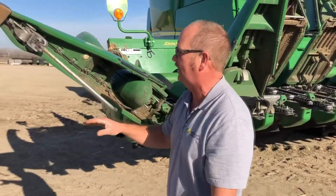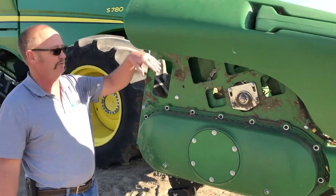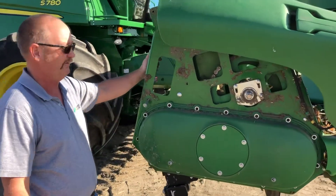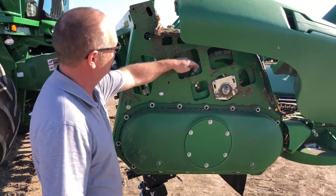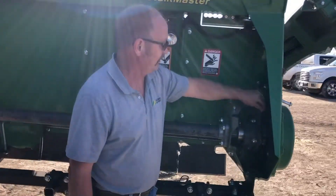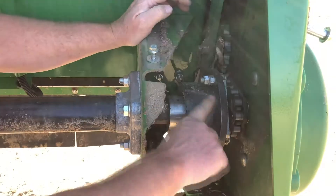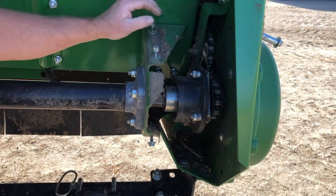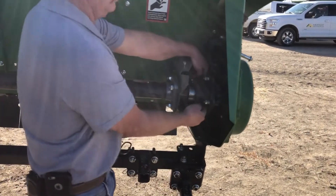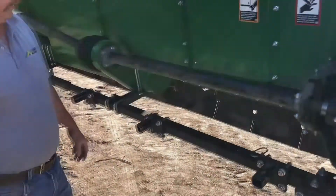Your adjustments for your snoots are there. I have this snoot flipped off to the side so we can get at it easily. Same chain on this side — I do have this shield pulled off so we can see our auger drive chain, which is going to be the same on the opposite side of this head. Some heads are only going to have it on one side if you have a solid head. On the back side here you can see the tightener, the idler, and the slip clutch for it. This slip clutch is a 50-hour — or annual, 200-hour — greaser. They recommend 10 pumps of grease. There are multiple zerks here, but you only grease one of those zerks, 10 pumps. That's the slip clutch for the auger.